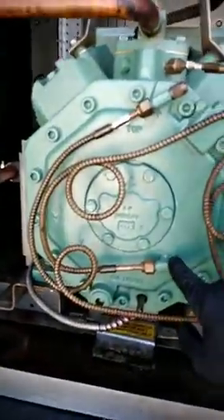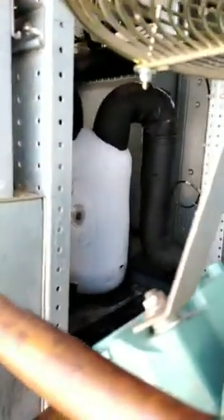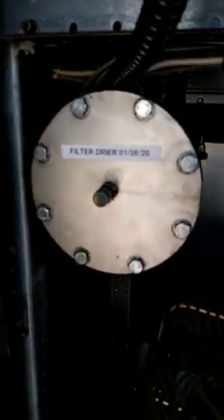With the inlet valve off, this thing fills up with oil. I was having to pump the oil into this compressor to lower it — even with no inlet — and I pumped it down, popped it off here to make sure it wasn't just passing even though I thought it was closed. You can kind of see a pear shape, a little bit of light on the accumulator. I had changed the liquid dryer back in January last year and there was a bunch of wax inside the shell. I'm going to take that out today and see if it's filled up with wax again. If that burnout was real bad it could have clogged the J-tube where the orifice or screen is at the bottom of the tube for the outlet.